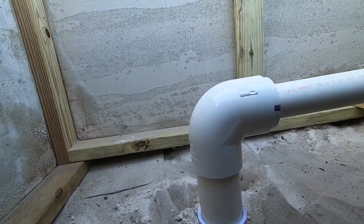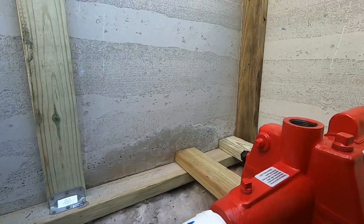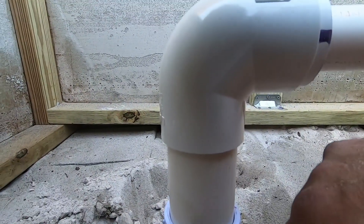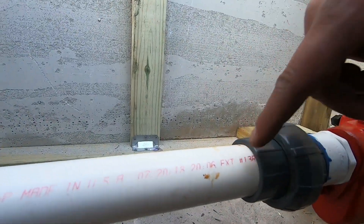I had some technical difficulties with my camera, but now this is what we're dealing with. I haven't glued this yet, or this, or this one. The reason why you want to do that is because if you glue it, it's there — you don't get a second chance. So I always dry fit everything. In other words, don't put any glue on it, make sure everything's the right length, then go back, disassemble it, and put the glue on. We're getting real close to having water.